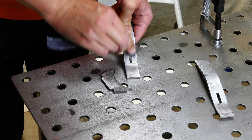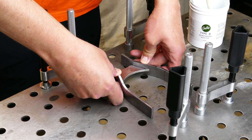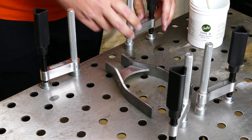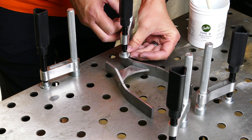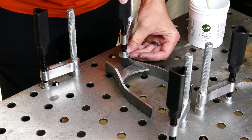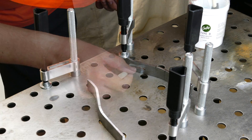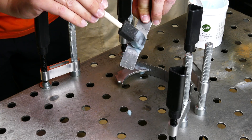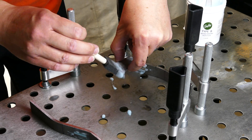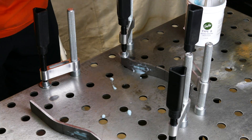The first step is getting everything nice and shiny with emery cloth. I'll be using my cheap welding table to braze the yoke. Most tacking and brazing is done in the jig or in the park stand, but neither of those would work for this kind of thing, so it's nice to have the welding table as an option. After cleaning everything with isopropyl, it's ready for flux. Getting flux on all the surfaces was a bit of a process, but having it partially clamped to the table helped.